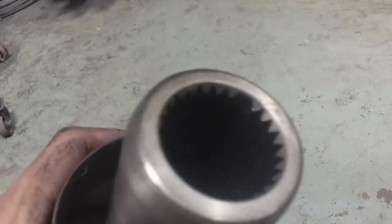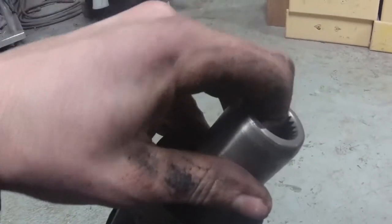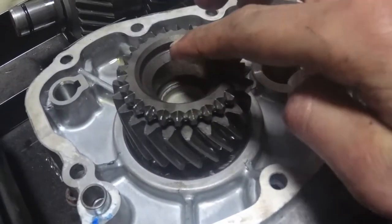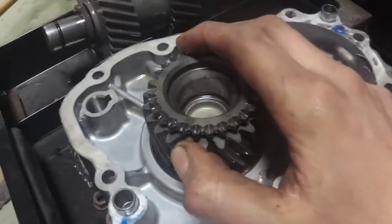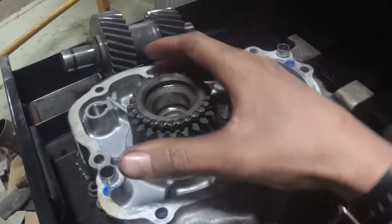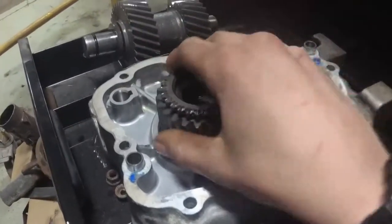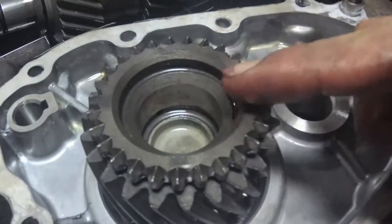So the idea is: since this is splined — or well, it's got two larger ones that you might use as a kind of keyway — we'll make a shaft with a spline on it that will fit into here fine. The outer diameter on the bottom of it will match this diameter in here, so we can push it in here and hopefully just TIG weld that in. Welding the hardened steel isn't really great — like the axles, those are hardened but not nearly as hard as this is. So I'm hoping we can just heat this whole thing up red hot, stick it in the sand, let it cool for a while, and hopefully it'll anneal a little bit and weld a little nicer. I'll probably just grind this out a little bit more and TIG it in.